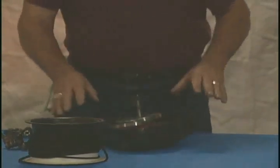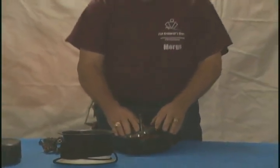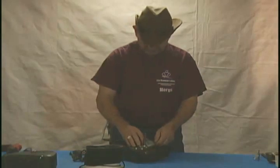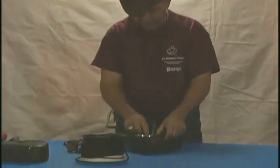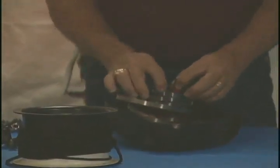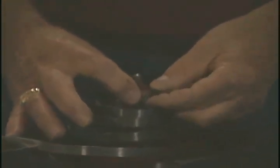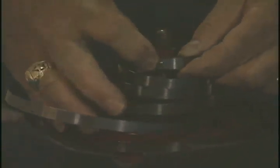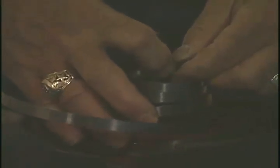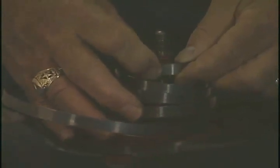This is a three-spring system. The way it works is each of these are stacked on top of each other and they are all connected to a small plastic piece by means of a screw. Commonly what happens with these is that over time, if these spools go backwards, you'll put a kink into the wire or they'll break at this particular point. In order to connect this back up, you're going to have to put a hole through the spring to have the screw go through.